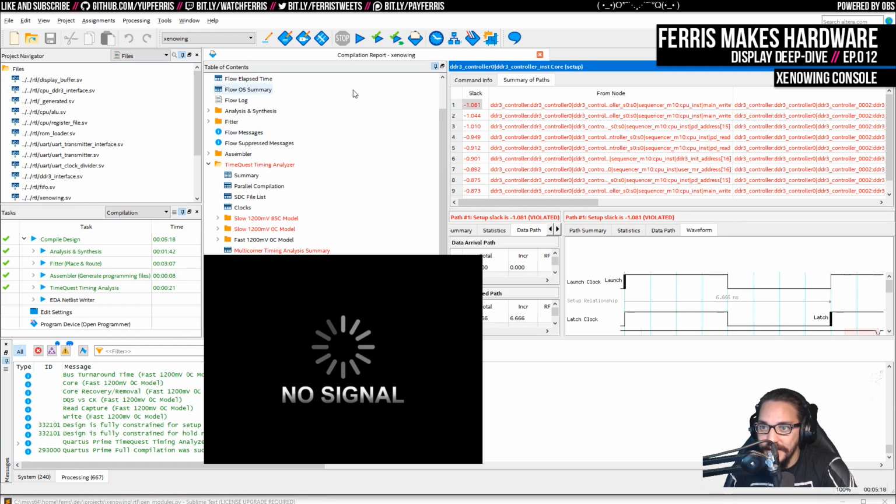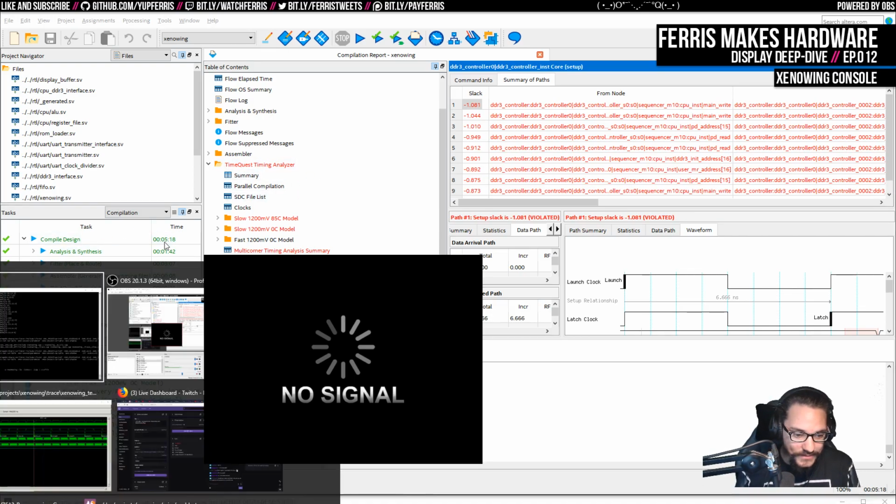But why doesn't this work? That is the question of the day. One of the things that you can't really see, but on the system itself, is I have an LED that I typically pulsate as everything is running. And what's interesting here is that that LED is not pulsating. And typically that means we didn't get to the main loop.